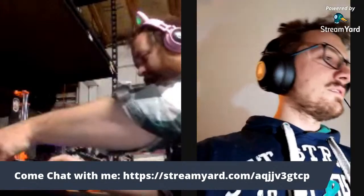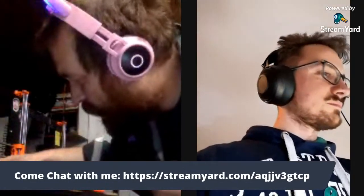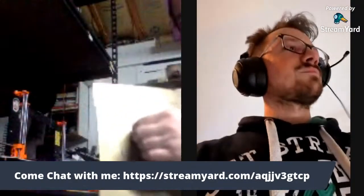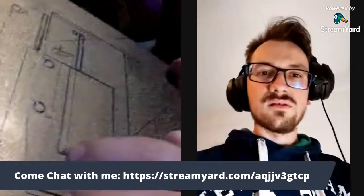That's a pain. But the other thing is, if I don't clean the bed, what's happening is the print nozzle is catching on some gunk left on the bed. I don't know if you can see it, but this little bump here is where the nozzle caught. So I got to do a better job of scraping this off. But it's hard because I have this textured bed and I have to scratch the PEI off sometimes to get the part off. Very annoying.